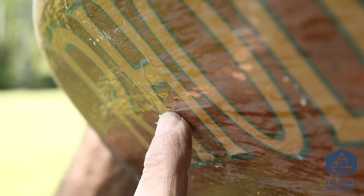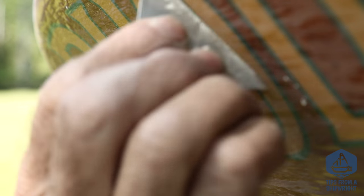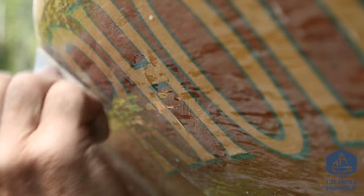It's got a black bristle in it right here from the previous varnish job, and it's got some runs above it up in here, and I'm going to try to scrape all of that out at the same time. You just thin that bristle right up, and then all of a sudden it just disappears. You can see that the runs just appear very quickly as soon as you scrape over them, so I can concentrate in that area and flatten that right out. I can feel it right underneath the razor blade just getting flatter and flatter every stroke I make at it.